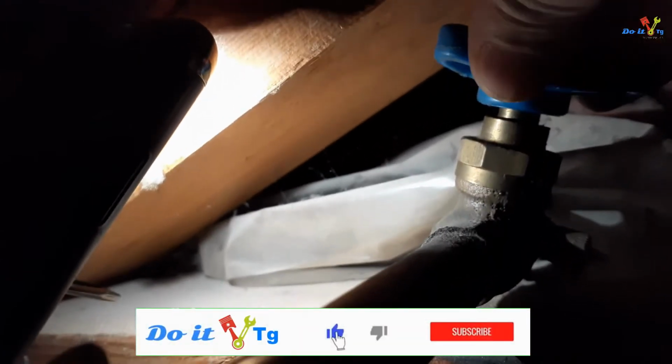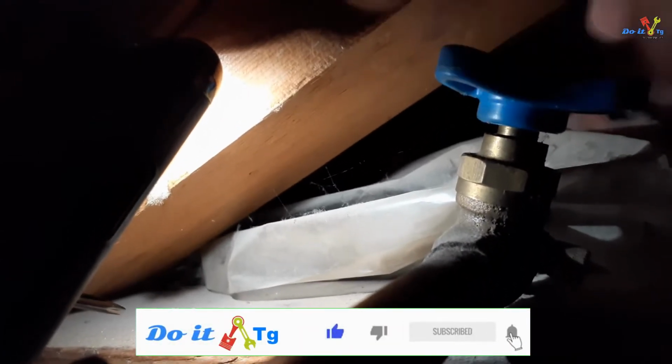First thing to do is to turn off the main water line. It is very important, otherwise you will waste a lot of water and it will be difficult to work too, especially if it's hot water. Cover the bathtub hole so you don't drop any screw or other parts.